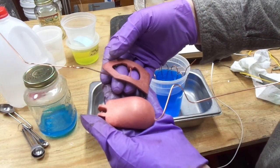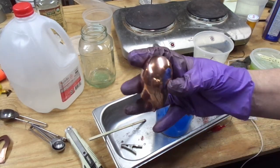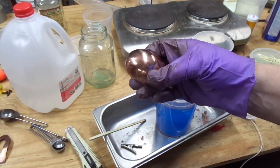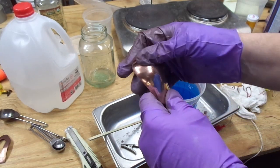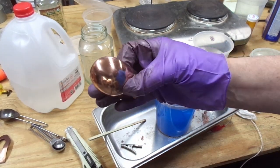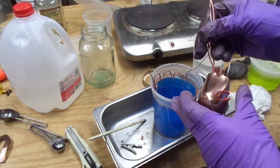The next trick will be to see how much I can polish that up. While I tried to polish the copper, it seemed to almost take all the copper off. I had this looking pretty good — getting a bit of a mirror shine out of it — but I wasn't sure what I was doing and had a tough time getting it to look good. Eventually I figured out my plating times weren't long enough, and I ended up putting it in the bath for 15 minutes at a time. Now it's got a pretty good shine — definitely a nice coppery color. The back has a real orange tone to it. I ended up making a more elaborate cradle for the lever cap.